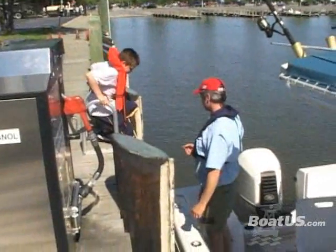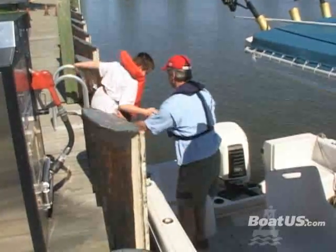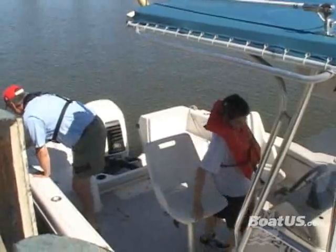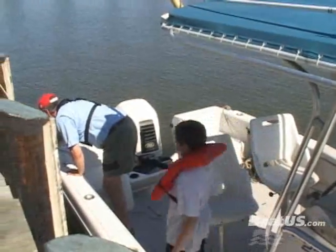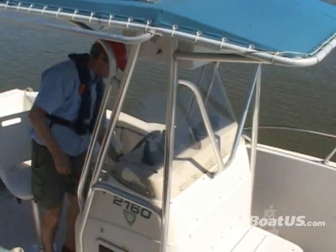If your boat's engine is in an enclosed compartment, turn on the blower for at least 3 minutes. It's also a good idea to open the engine compartment hatch and check the bilge, and do a sniff test with your nose. At busy fuel docks, resist the temptation to simply start the engine and cast off. Taking just a few extra minutes could save your life.